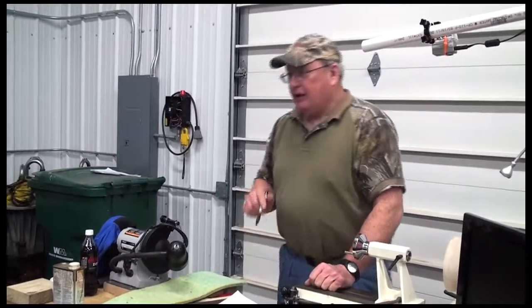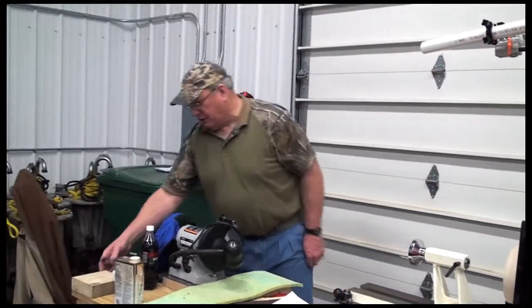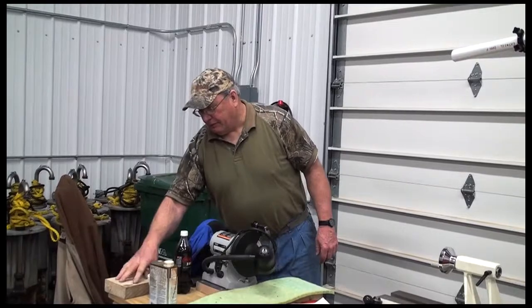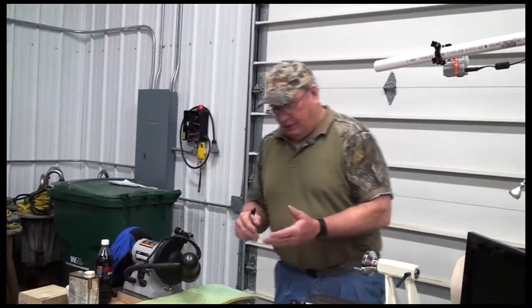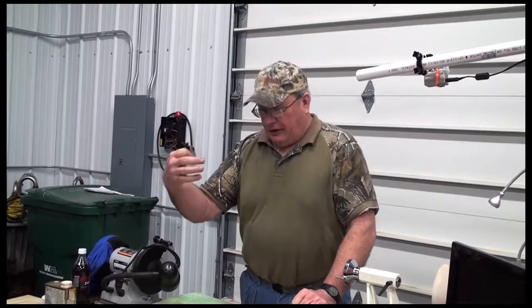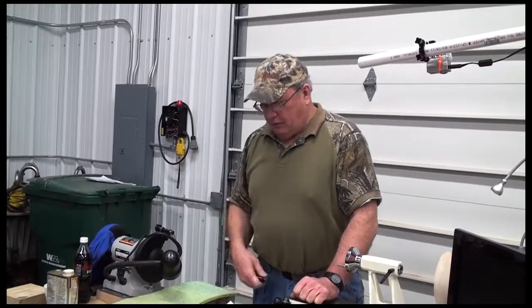I think this kind of project is like Tom — when he does his piercings, there's an eye appeal thing there. It's different from what everybody else is doing. He puts something out there that's got color and holes in it — it draws people in. The other big thing is you can use wood that nobody else wants. I picked up this piece of spalted maple — it'll make a beautiful bowl. But what I use is basswood with no knots, no features; maple, no knots; cherrywood, same way. The things that most people find unattractive for turning lend themselves to this.